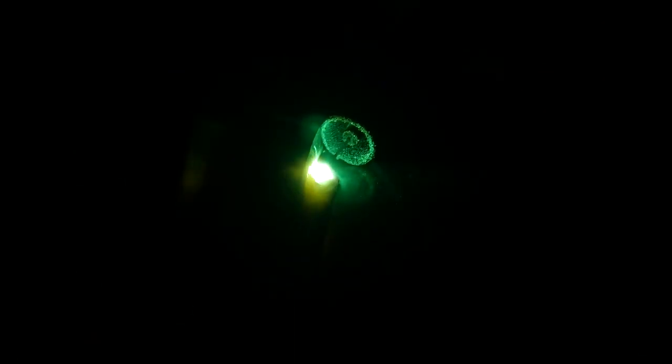The inside flange was welded at 260 amps, and then the outside flange, usually I turn it up a bit more powerful on the torch, anywhere from 270, 280. Anytime I start going over 300 amps on the outside flange, I realise that it's just not nice, it's not a smooth weld, it's too powerful. And I think it's because at that power, you'd want to be using 1.2mm wire to get the benefits. So all it does is just throw off the nice smooth cap.